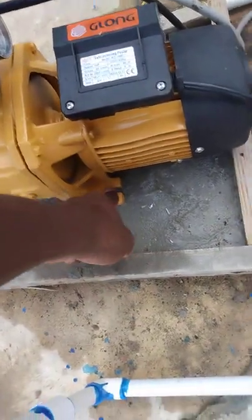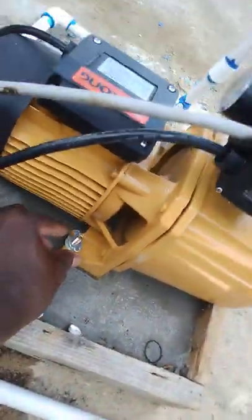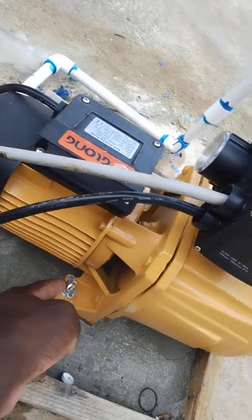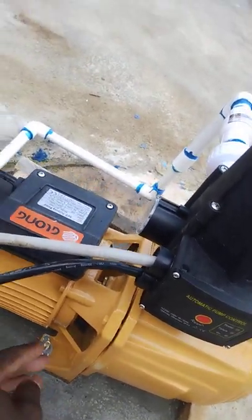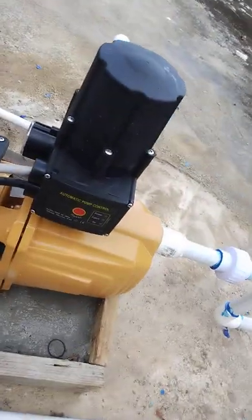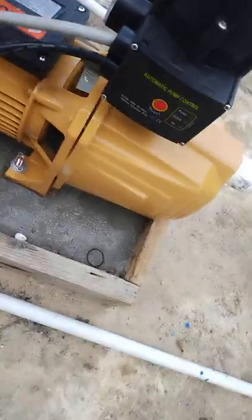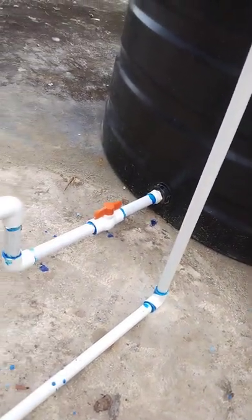The pump is anchored to the floor by two screws — one is a concrete screw, and I added extra reinforcement. This is actually a genius part: it's a tank-to-bowl screw used on toilets. I turned the flat head down into the concrete with the threaded part up and tightened it — the reverse of how you'd use it on a toilet tank. I also did a little precast here so the pump is not sitting directly on the decking. I like to do that, and I even put the tank itself on a platform.